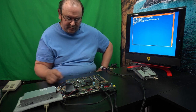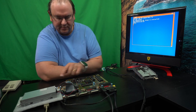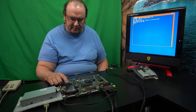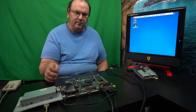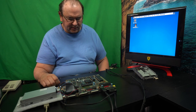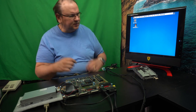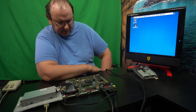So we have the battery backed up, real-time clock seems to work, because if this battery wasn't connected in the circuitry as intended, the only long-term test one would have to do is put it in the cupboard for a month and wait for the battery to run empty completely, if it wasn't being recharged. If one was really interested, one could measure the voltage over the battery to see if it actually goes up to levels that one considers it would be charging. But anyway, that's good.